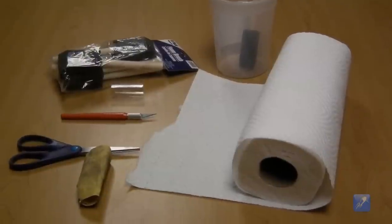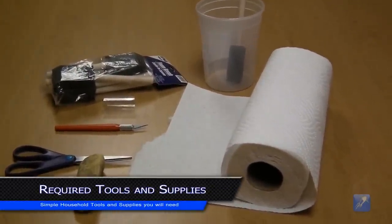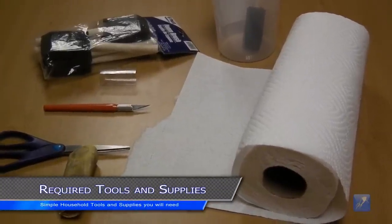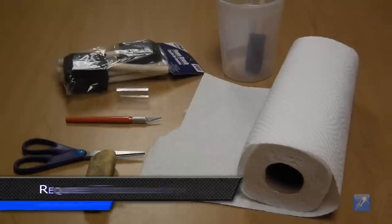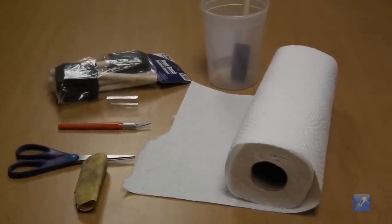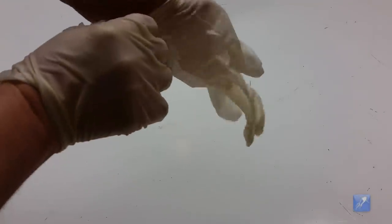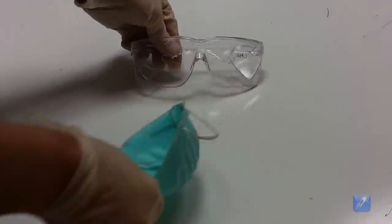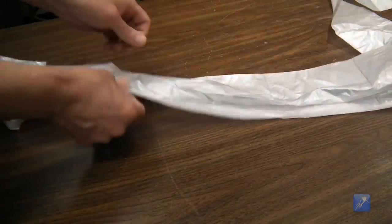In general you will not need any special tools. You will need standard hand tools like scissors, files, saws, and sandpaper. A good plastic container to mix the resins in and a sturdy mixing stick is also required. Paint brushes are needed to apply the resin, and also have plenty of paper towels and rags on hand. Composite fibers, dust, and resins are nasty chemicals, so always have gloves and eye protection, and a respirator or face mask is recommended when working with them. You should also protect your work area with newspapers or a plastic drop cloth.